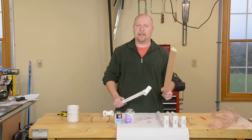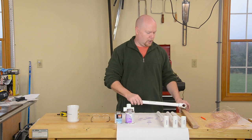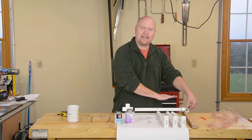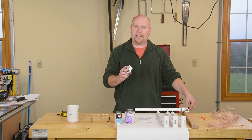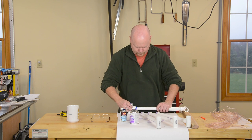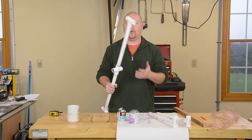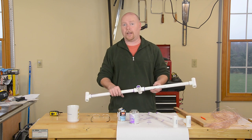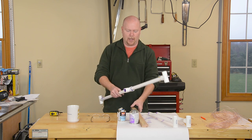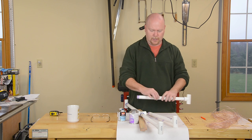The way I like to accomplish that is to get a spacer block that is roughly the same height as this X piece is set up on end. That lets me take the arm and lay it flat out here and just slide the X straight on. By doing this, what I'm really doing is referencing the flat side of the end piece with the flat face of the X, both against the bench surface. With two of these things in here now, my alignment philosophy doesn't work anymore because I don't have a spacer block this tall. So what I'm going to do is swap places — bring the spacer block over here and put that underneath the X, and then use the flat face of this piece to make my final alignment.